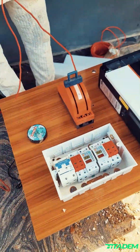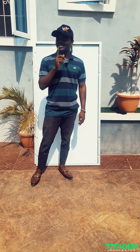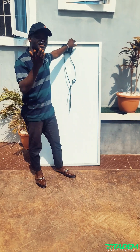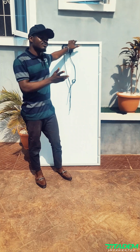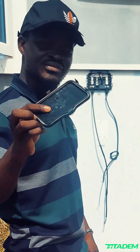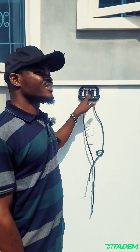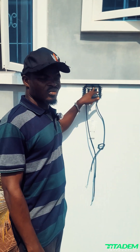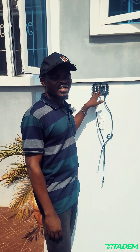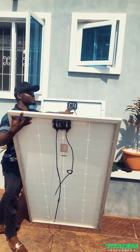We're back on site — day two. Remember I said we'd connect the 300-watt panels two-by-two? Plans have changed. Upon doing that connection, we discovered something: the solar panels up there were also affected by thunder. In fact, they were so badly burnt that they are beyond repair. We might have issues with partial contacts if we try to use them, so we are just going to replace them. We found three damaged panels — all burnt.